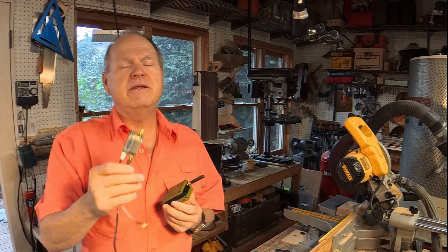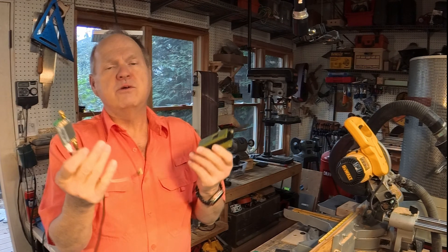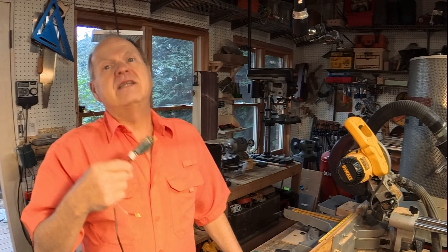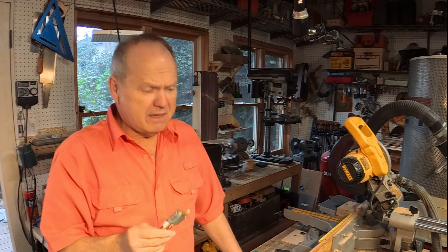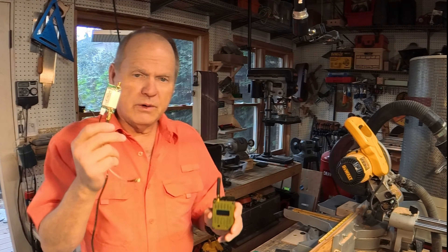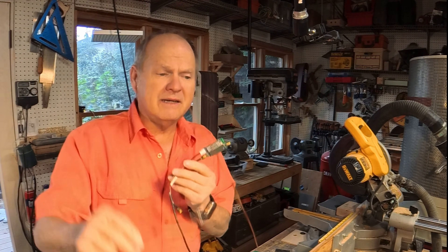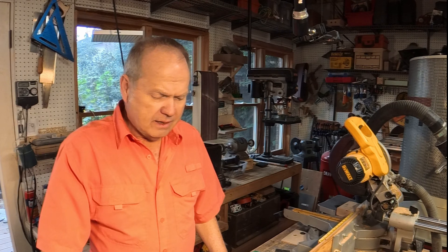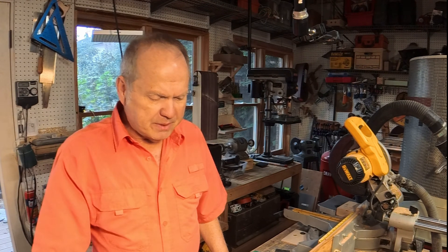Combine this amplifier and a better antenna with your stock radio — now you're receiving better, you're transmitting better. In the antenna video, we talk about height: get it as high up as you can. I use a combination like this — a small Meshtastic radio going into my amplifier, the amplifier feeding into the antenna up in the very top of my attic roof. That has greatly improved the performance, the distance, and the number of nodes that I can communicate with. It really makes a big difference.